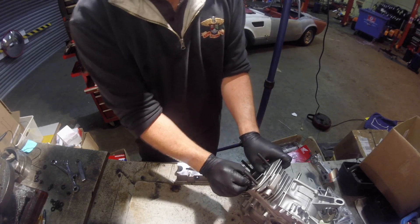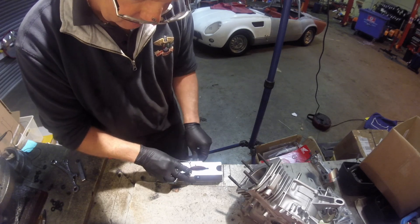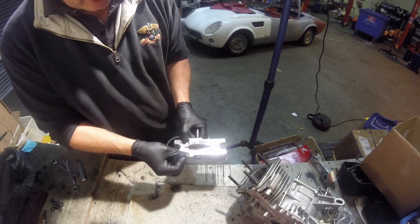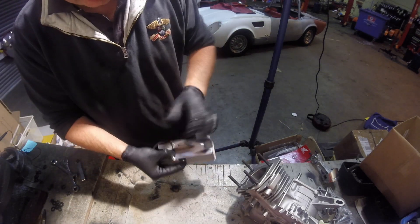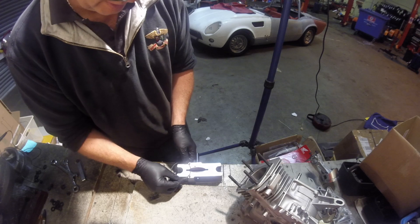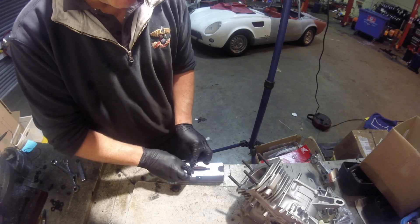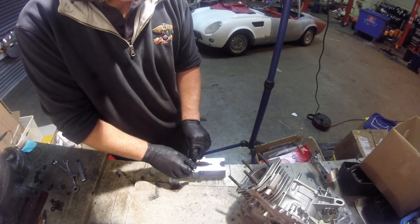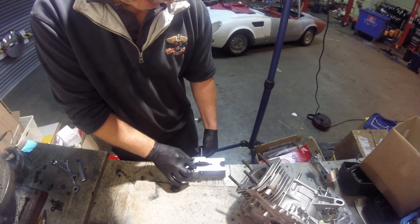Place it back in the piston ring filer. You're only aiming to file one side — this side isn't actually contacting the abrasive wheel. I tend to put a finger here to hold it on, push a little bit of pressure in and against the studs, and that holds it square. It's easier to take a little bit off at a time rather than taking too much off — you can always remove material but you can't put it back.